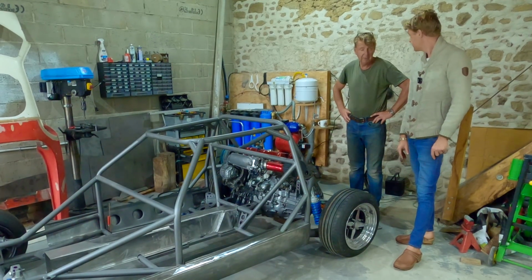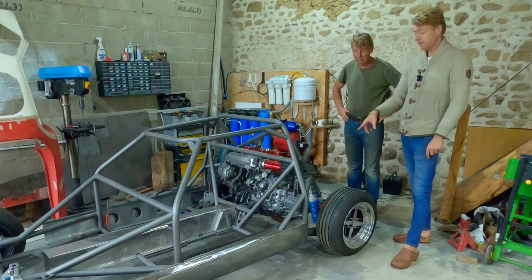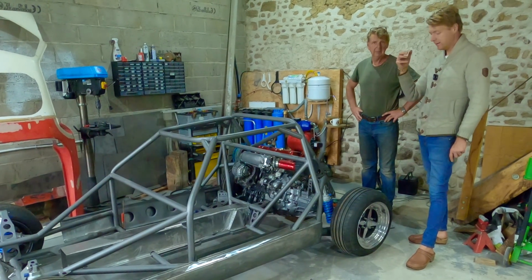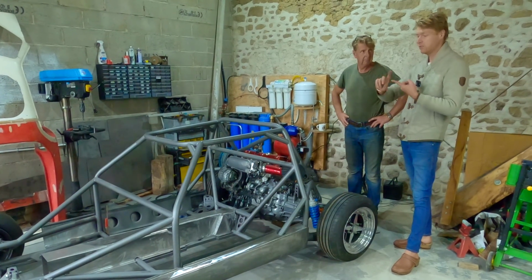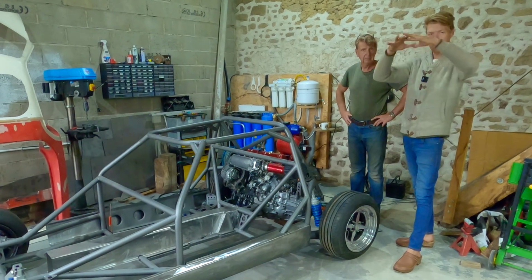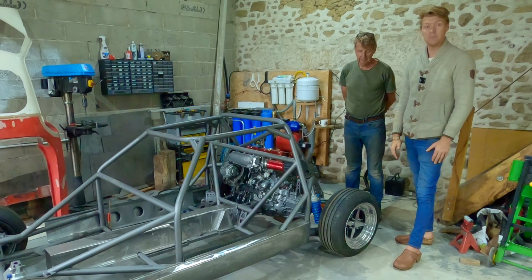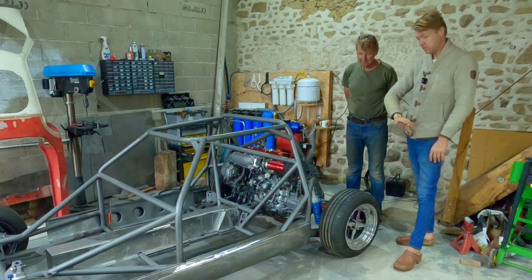Yeah. And all it is is shock placement. Shock placement, that's all. Well, that's the thing. Huge difference. These are off-road racing shocks for an off-road buggy, and we're using them on CRV suspension. And if you look on a CRV or an EP3 Civic, which is the jelly bean looking one, they've got really short shock absorbers. And we wanted as much wheel travel as humanly possible. And we ended up with a bit too much. But this sorts everything out.